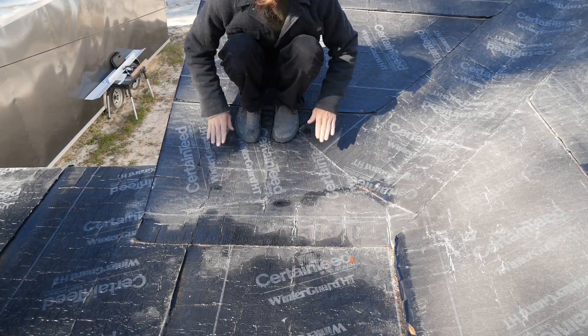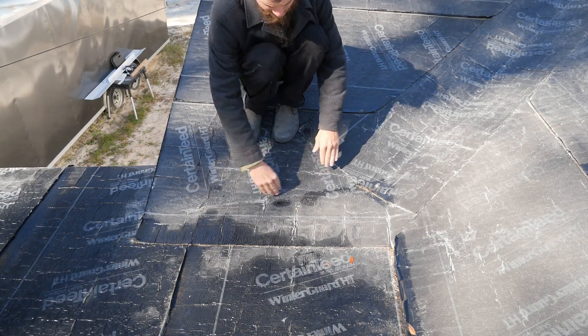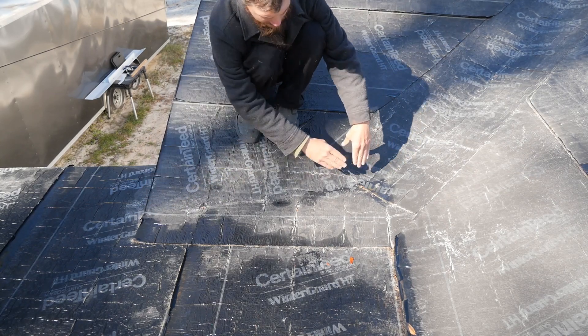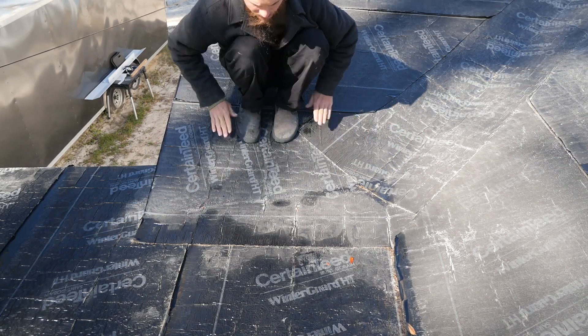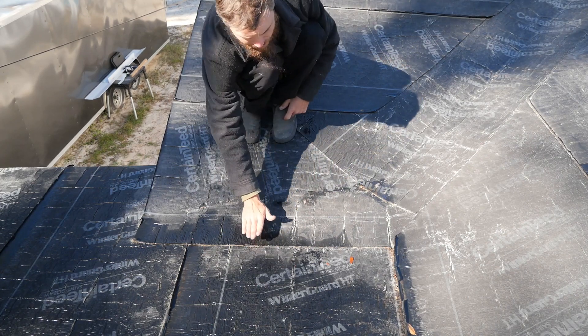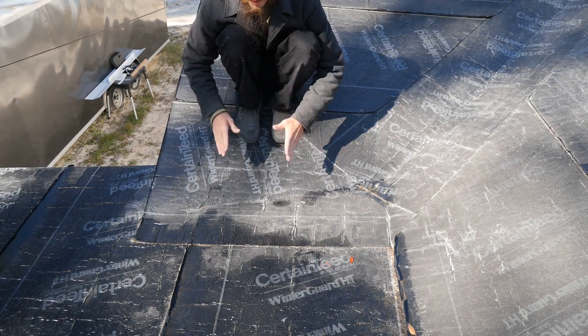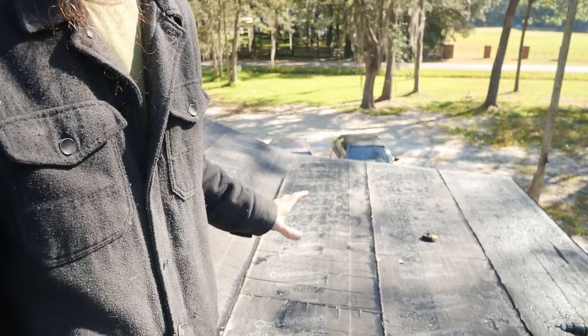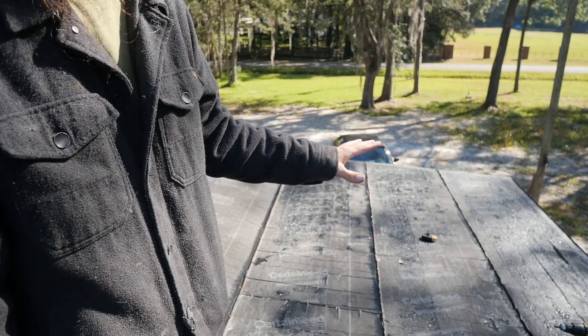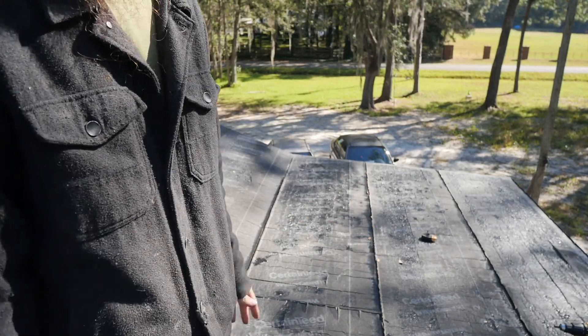Looking down at it — we have the roof going down here at an angle, and we have the valley coming down and angling, but we don't want water going underneath our porch roof which is flat and perpendicular to this roof. So I guess we're going to start here. I'm going to bring up a couple sheets of metal, get them squared up, and we'll just start the porch and see where it ends.